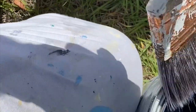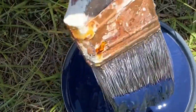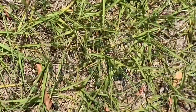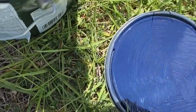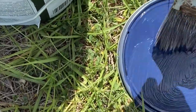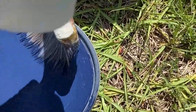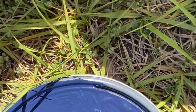A pro texture applier holds the hopper or the applicator at the same distance, at the same angle, consistently throughout the ceiling or the wall. When you don't, you have some texture that peaks in the middle, some texture that peaks on the left, and others on the right. And this produces the light to be trapped against these peaks, which casts different shadows. And so you get angular flashing. And you might think it's your paint, when in fact it's not.